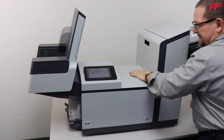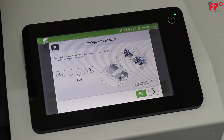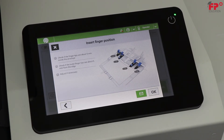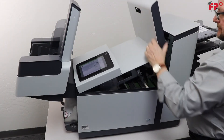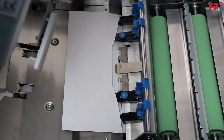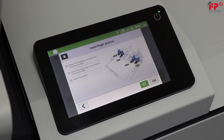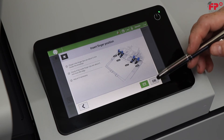Close the upper unit. Touch the right arrow to check the opening of the envelope by the envelope fingers. The specifications are shown on the screen. Open the upper unit and check to see if the fingers are inside the envelope, adjusted correctly for the envelope size, and to make sure it is only opened enough to allow the insertion to occur. If the fingers are not adjusted correctly to the width of the envelope, or depth is not correct, a stoppage can easily occur at insertion. Depth is adjusted with the envelope stop position adjustment on the previous step. Use the arrow in the lower left corner if the finger depth is too deep. Otherwise, select OK.